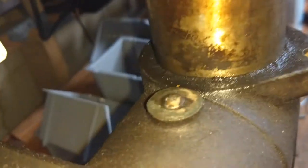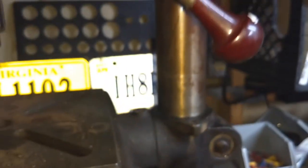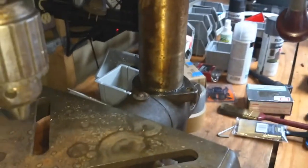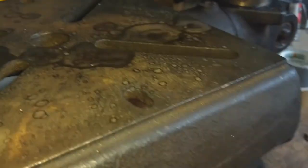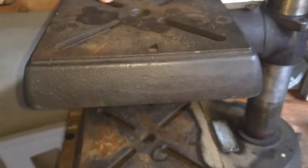Or is this a bolt that's broken off? Uh-oh. Can't tell if that's... No, it's this bolt. Hey Dave — that, I think, is a safety bolt that locks it at 90 degrees. I'm a smart guy. I've worked with shop tools before. That's your pin that locks it in place. I think we can drift that out. And then loosening this guy down here allows us to tip the bed left or right.